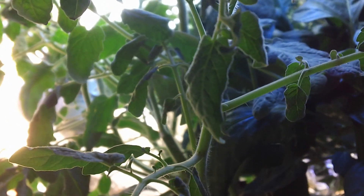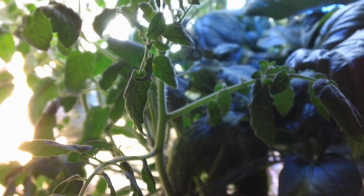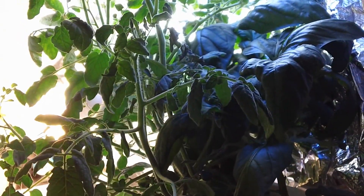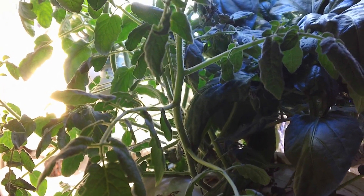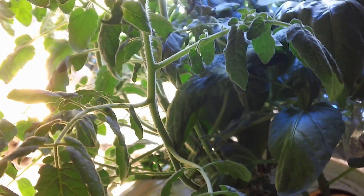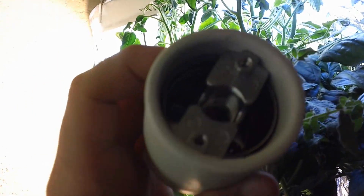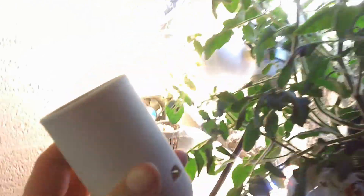So I had to get a mogul base for it. This mogul base, you wire in directly to some wires, so I'm going to have to do some wiring. I could not find a mogul to standard base adapter anywhere in town and didn't feel like ordering one online. You wire your 110 here in the US, and this part screws onto the base for support because it's a big heavy base. It's non-conductive ceramic — pretty heavy duty — and the threads are ginormous. This thing is about as big as one of these 100-watt CFLs.